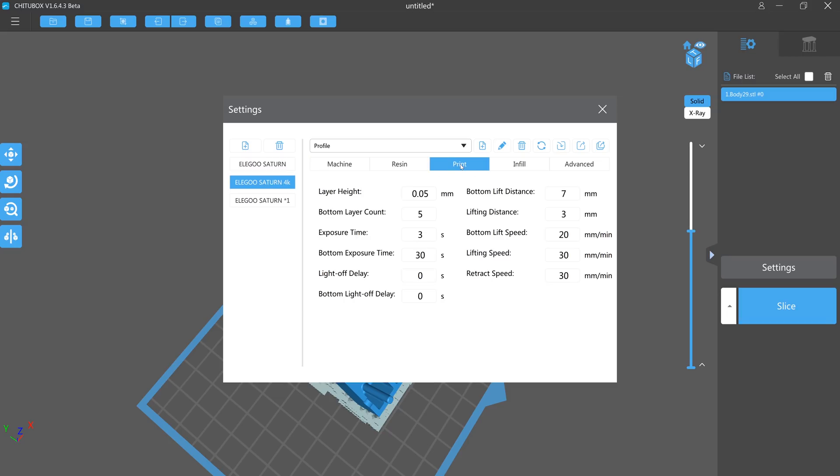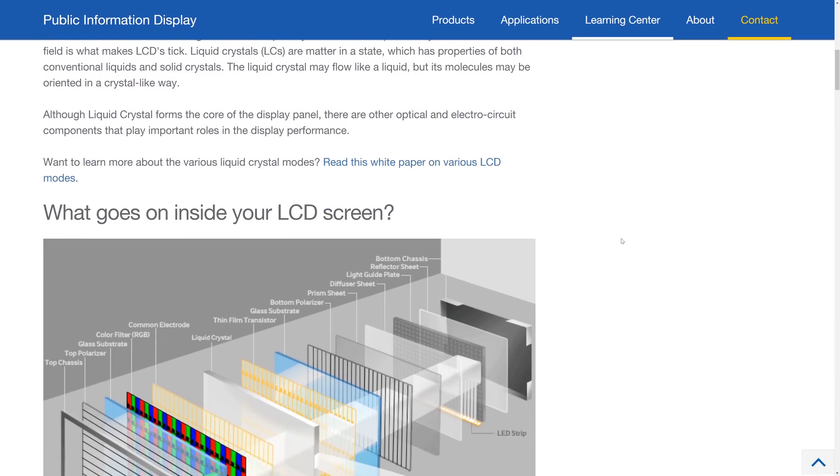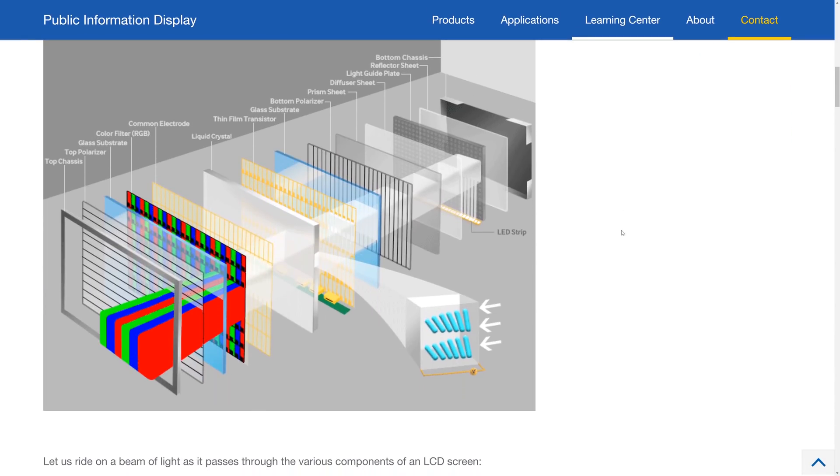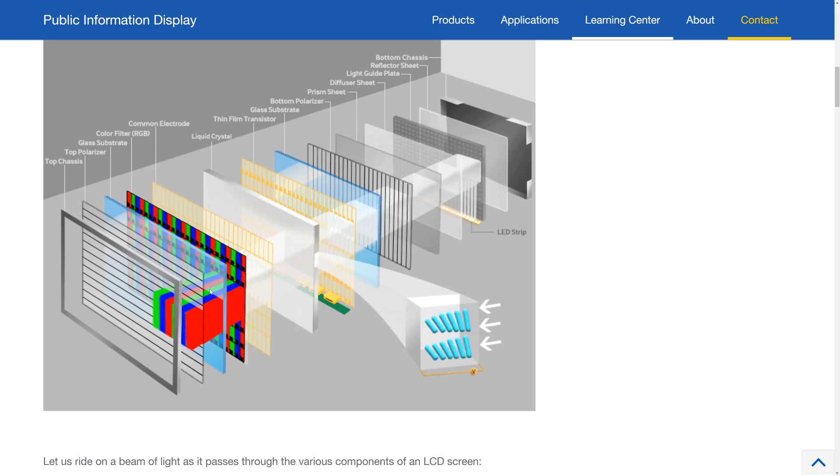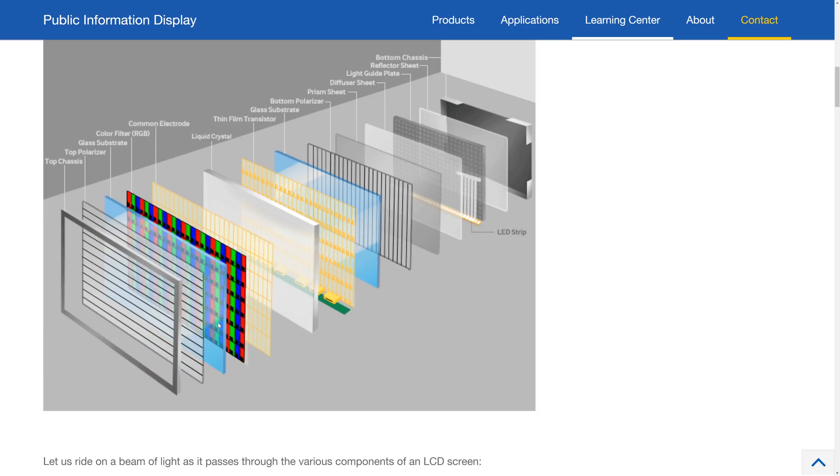The resolution in combination with the build volume adds up to just above 500 DPI — that's a big deal, far beyond the competition in this price class. And there is yet another surprise: the exposure time they are suggesting is much, much lower than that of previous comparable machines. They are not using face-melting, four-times-more-powerful illumination to accomplish this. They've simply equipped an LCD panel without the useless and inefficient color filter layer. That monochromatic display seems to make a huge difference in print time, energy efficiency, and LCD longevity. Absolutely beautiful innovation — I hope.